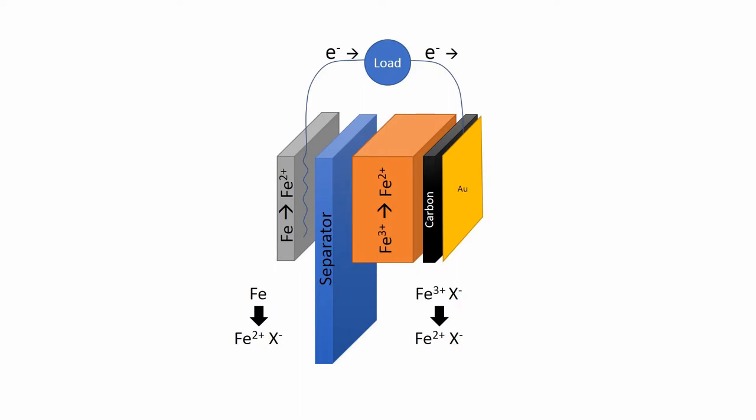For those of you who are new here, for the last year and a half almost, I've been working on developing an all-iron battery chemistry with an iron anode and some form of iron salt as the cathode. That way it can't self-contaminate like lots of batteries can, where the anode mixing with the cathode destroys the battery — this would just be rechargeable even after such a contamination. It's also made out of iron, which is non-toxic and cheap. We make more iron than we do just about any other commodity, on a scale that is almost unimaginable — orders of magnitude more than any other battery-type material like lead. So it seems like a good match to make a battery for a really big application like grid-scale backup or storing renewable energy for use when the sun isn't shining or the wind isn't blowing.